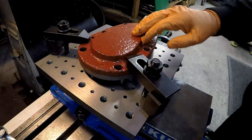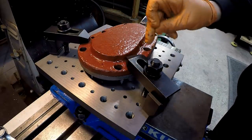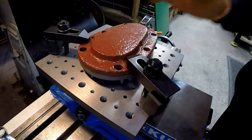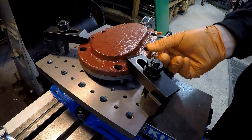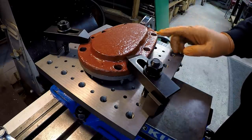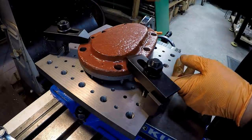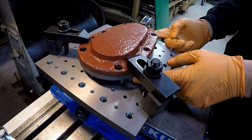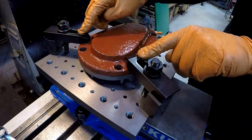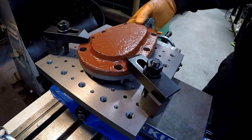I decided to use the sample, and we're going to line up on each one of those holes, because as I was transfer punching, I noticed it was shifting just a little bit, and I want those holes to be exactly in line with those so that I can use through bolts later and hold the two castings together. So we're using a fixture plate. We got two clamps, and we're clamping down on the three points of contact here on the fixture plate. So we've got a solid mounting point here and here, and also on this side with the C-clamp style holding that one right there.